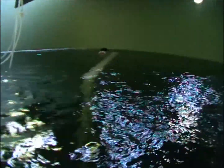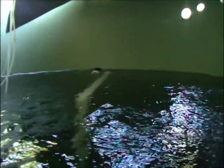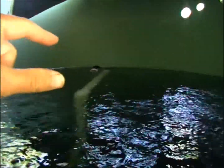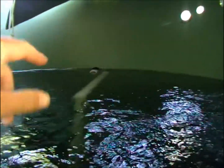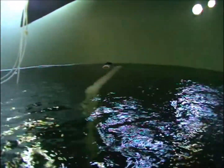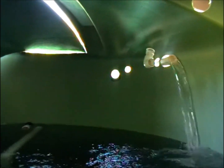They're coming in now a bit lower. You can see the outlet on the left side skimming the top - there's a little knob sticking out of that tank wall there that's skimming the top of the tank. The other one has a 45 degree bend and it just takes all the crap off the top. This tank is basically clean enough to drink the water, and it's inside green all the time. That inlet goes all the way to the bottom because of all the heavy waste.